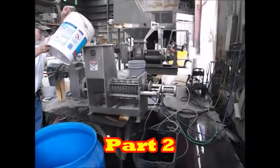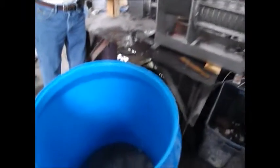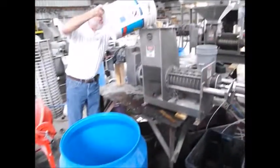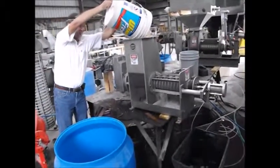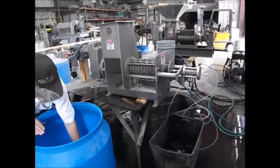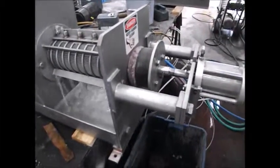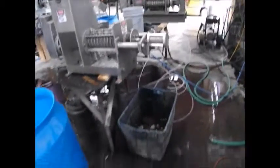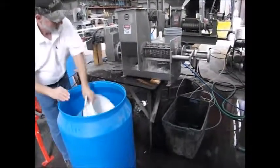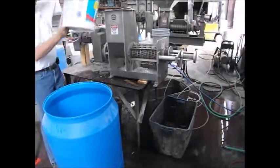So we're back, and we've learned some stuff. It takes a lot of material — here's what's left in our bucket. Pour about three buckets in. I've been feeding it, and you're seeing now we're starting to just now push the cone open — very low back pressure too. What I've learned is, you can hear that press, we need to go with a continuous flighted screw.